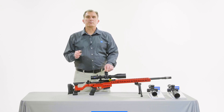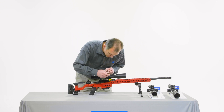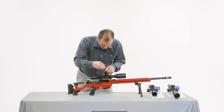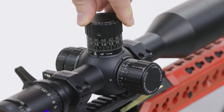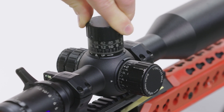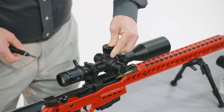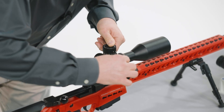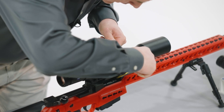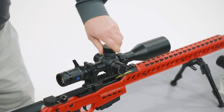In order to do so, we need to begin by loosening the two set screws once again. Loosen the first one, loosen the second one. Now press down all the way until it comes to a hard stop. Rotate until it comes to another hard stop. Tighten the first set screw, then tighten the second set screw to the appropriate specifications. And we're done — it's that fast and it's that simple.